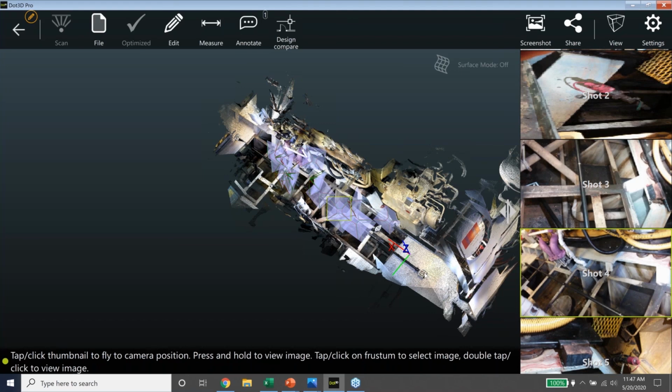And we're doing a bundle adjustment or least squares fit here. You would prefer to be interpolating rather than extrapolating. So if I can wave my hands just a little bit, what is ideal is to have the scale bars running the full length of the scene, ideally the full width too. But if I had to do it again, I would have run the second scale bar at right angles. But no do-overs here.